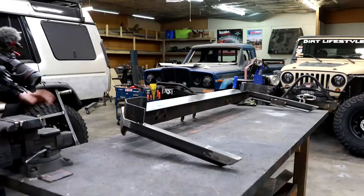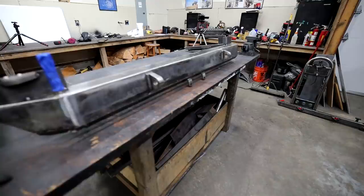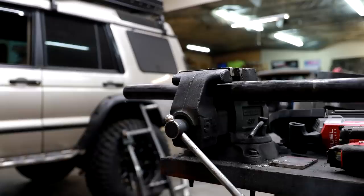We are finally at a point where we can finish weld this bumper. I'm going to fill in all these little discrepancies and then do some really short welds, just bouncing around so we don't get one area too hot. There's always a little bit of shifting, shrinking, and expanding that goes on. But if we're not too greedy and we do this slowly, it's going to make it so whenever we go to bolt this back up, these bolt holes should line right up.